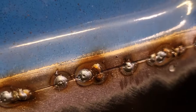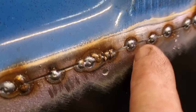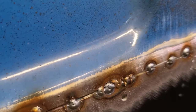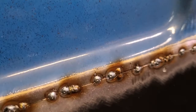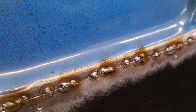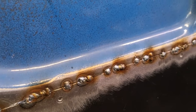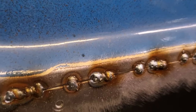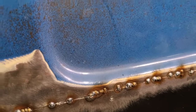But what I'm doing now is I'm picking up like that weld there, for example, this one here. Where's my finger? That one there. Then I'll join that 1, 2, 3, 4, or 3, across to the next one and so on. Sometimes it's really tempting if you're only one weld away from joining the next one to do another one or another one. I'm just stopping. Three. And by going one on top of the next on top of the next, then it avoids pinholes.